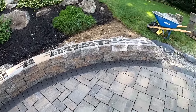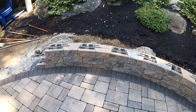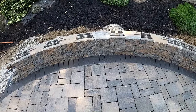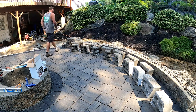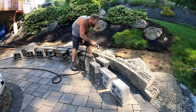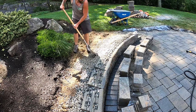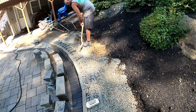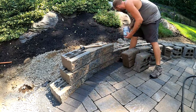It's all dry laid in there. I don't have the plastic tabs installed yet, plus all the blocks are pretty dirty and dusty from cutting. My next move is to pull everything off, put it down on the patio in front, wash the blocks off, and then put it back up with the pins installed. I'm going to give everything a good wash down, install the tabs, then put the blocks back on. Check out the channel for the next part, which is finishing off the ends of this wall — splitting the caps and building the corners — and then after that is the short video of how we installed the caps. If you enjoyed this video, hit that like and subscribe. I appreciate the support in advance — until the next one, God bless, and keep up the hard work out there.